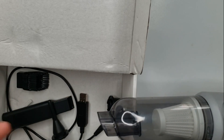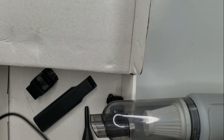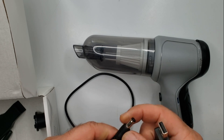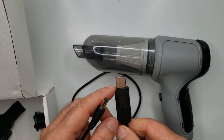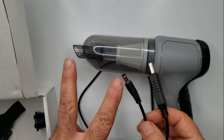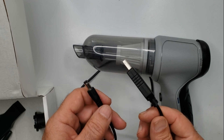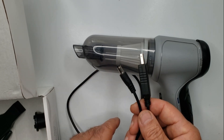Something that's very interesting: it didn't come with any instructions — it was supposed to be self-explanatory. But I looked at the charger cable and it basically measured out as eight volts. So I figured this is probably a boost cable — you put five volts in, boost it up, and you get eight volts out. Usually what needs eight volts? Two lithium cells, because they're about 4.2 volts each, so you want to get near that voltage for a full charge on two cells. Unless there's some fancy circuitry in there, but we're going to find out.